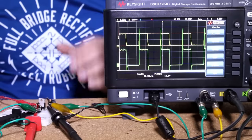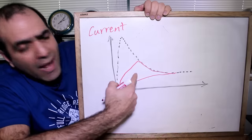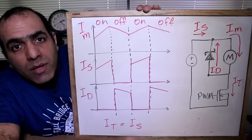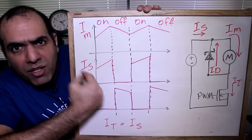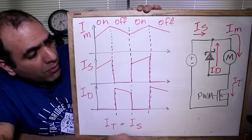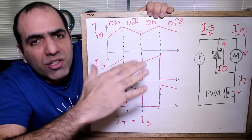This is how we manage the inrush current by controlling the motor supply. Instead of turning the motor dead on, we PWM it on and off and control the current until it hits the curve we want. We can completely remove the inrush or allow some acceptable inrush to get a more responsive motor. The motor draws current from the supply during the on-time and loops current through the diode in the off-time. The supply current is the same as the motor current in the on-time and zero in the off-time. The diode current is zero in the on-time and the same as the motor current in the off-time. We have to pick our components so they can handle this current, and switching large currents means electromagnetic radiation becomes an issue.